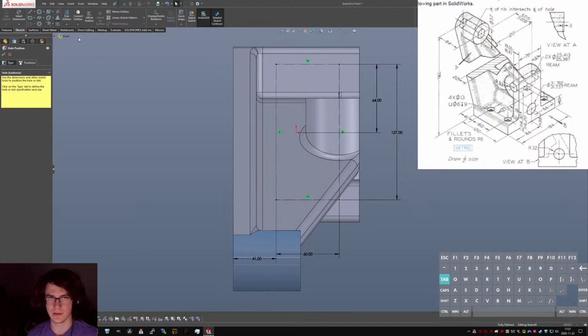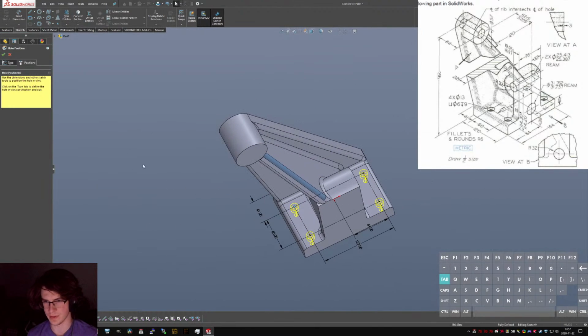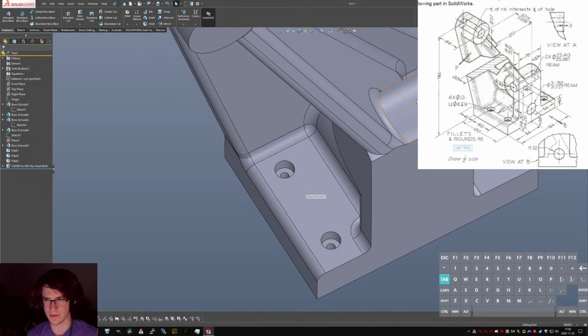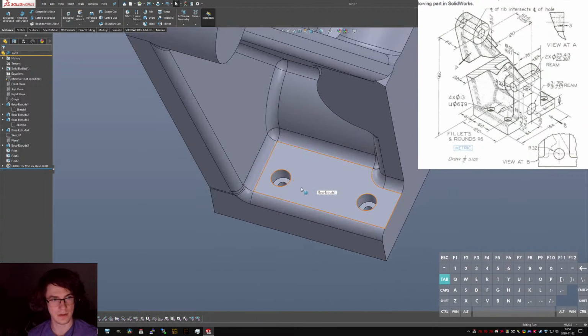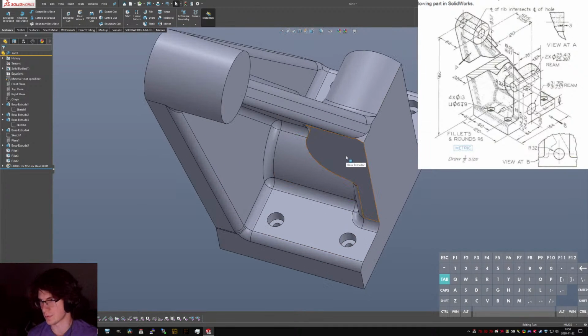I never like these kinds of drawings because it's not indicative of parts people would actually draw or design, because nobody would design a part like this. No reasonable person would ever design a part like this. But that's how I do those holes. If you know it's a rectangular pattern, you have all your references, and then you can just go boink, boink, boink, boink on all four of the corners. You don't have to do horizontals or verticals or anything to align them all up. You just have a square. It's a good reference, and it's done. So, hole wizards.